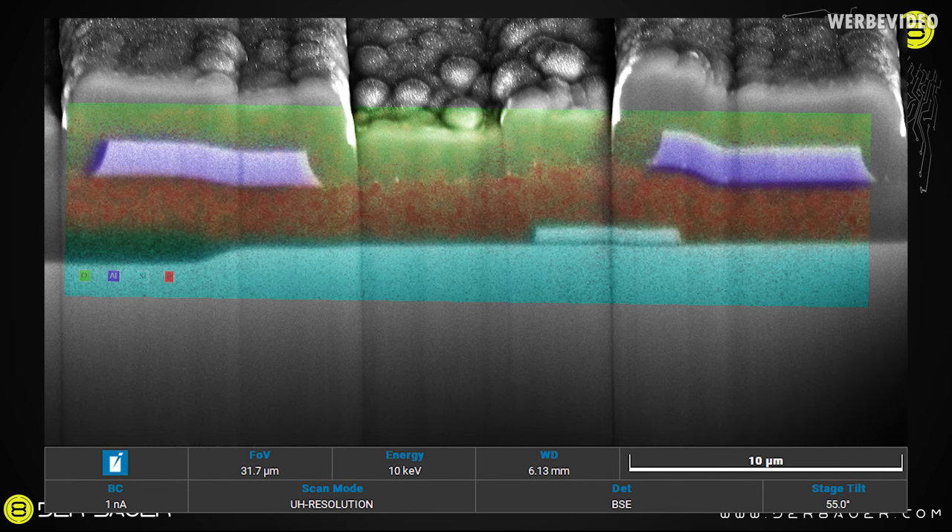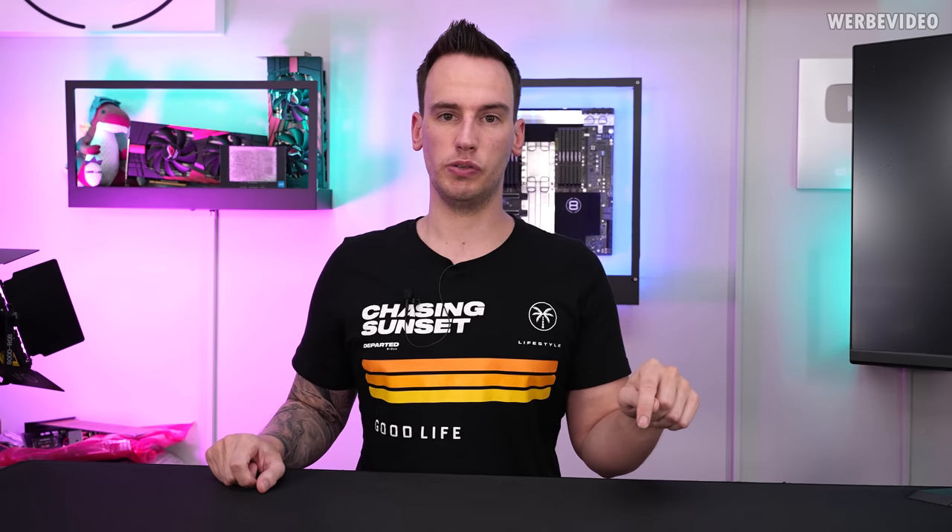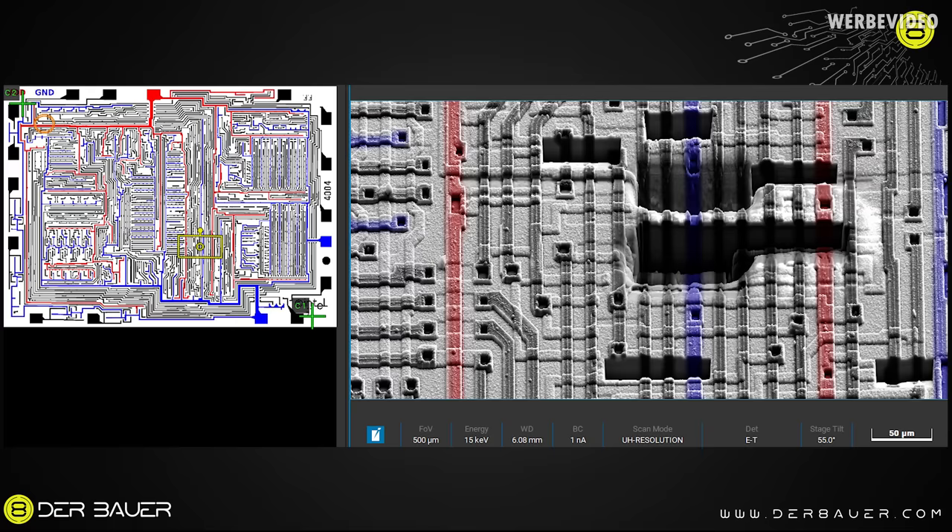The reddish colored layer in the center would contain silicon dioxide and phosphorus. We don't have a cross-section rotated 90 degrees that would cut through source and drain, but that's not really relevant. Just looking at these images and comparing them to the 10900K and 3950X images we already did, you can compare the different scales and see how much tinier the recent technology is. We also listed and hosted all of these images as a download in a zip file on the website — link in the description. There are also interesting images where TESCAN put the layout showing VCC and ground over some of the SEM images, so you can see how some of the SEM-visible traces are VCC or ground.